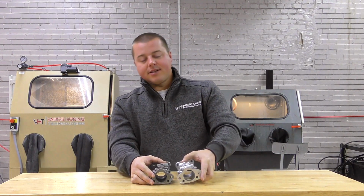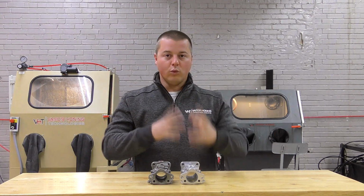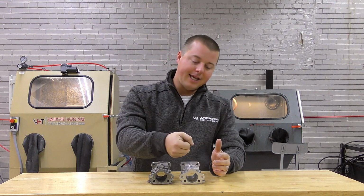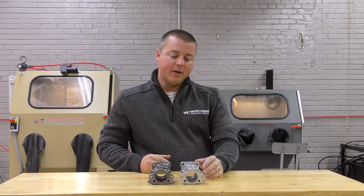And one of the reasons that it does not smudge the surface is because the water and the abrasive is mixed together in one liquid, and it's flowing across the part. It's actually not hitting the part and damaging or, again, moving the surface metal. You can imagine a garden hose with liquid or abrasive suspended in it. That's about what we're doing here.